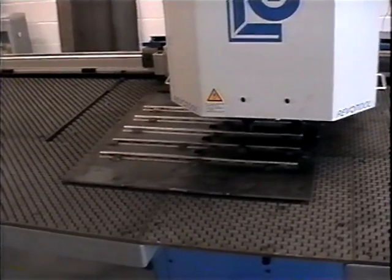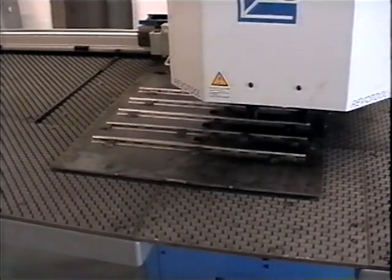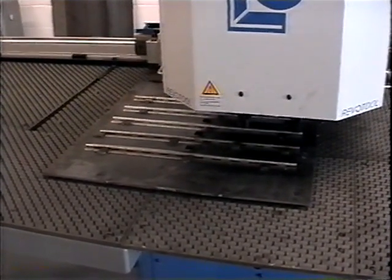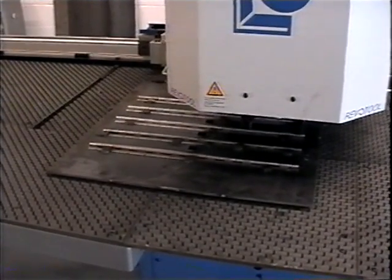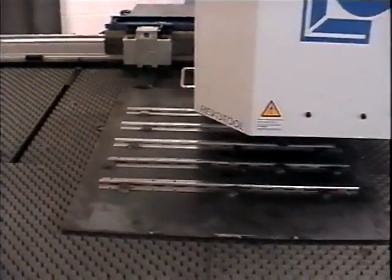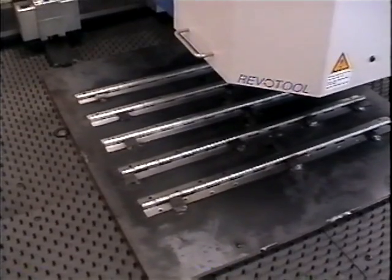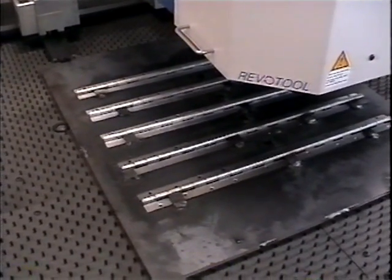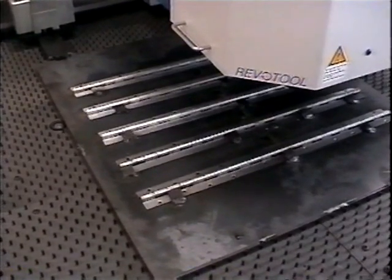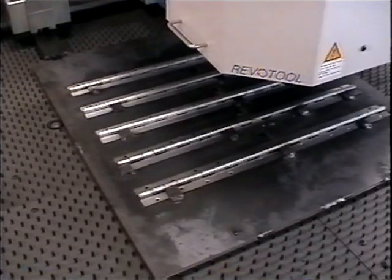The machine has finished the program at approximately 100% speed. We hope this has been informative. Really, it was an applications engineering job more so than a machine selection job. This particular one presented some problems in fixturing. Excuse the welds on the fixture — these clips were welded in to hold the tab in place, but what I would recommend in designing a production fixture would be to look in a Carr Lane catalog and get a quick-release toggle-type hold-down.